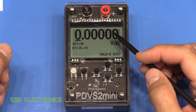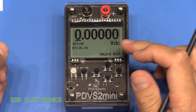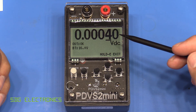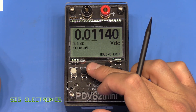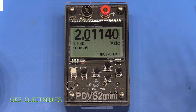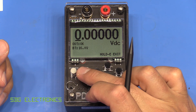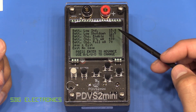The user interface is pretty straightforward. You've got the output voltage displayed at the top, the battery voltage of the two batteries in series, and whether the output is okay. You've got all your digits and you can move along to select which digit you want to change. When you press up you're outputting that voltage directly, so this is live setting - it's actually outputting that voltage on the two terminals. When you roll over on one of the digits it increases as you'd expect, and you can quickly clear all digits by going to the end digit.